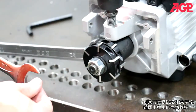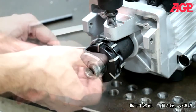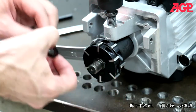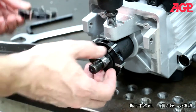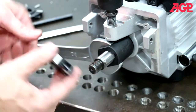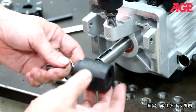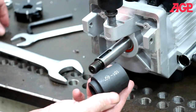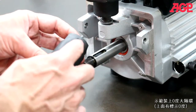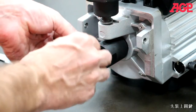To change the milling receiver on the EB24R, loosen the nut on the spindle. Then remove the washer, two milling discs and the spacer between them. Remove the parallel key and finally the milling receiver itself. We'll install the zero degree milling receiver — it's marked with a zero. Then reinstall the parallel key.